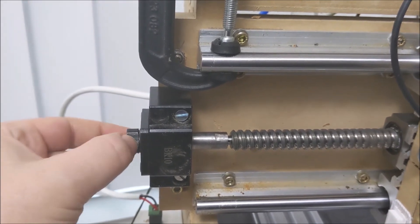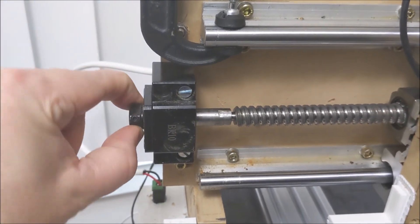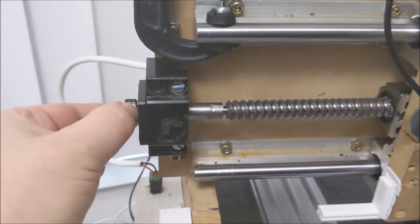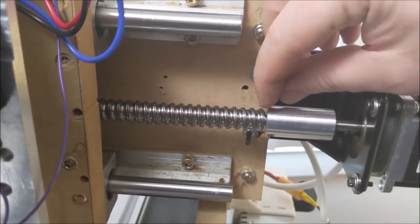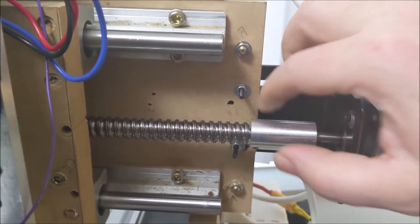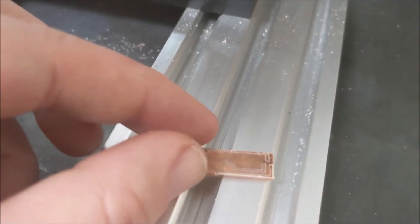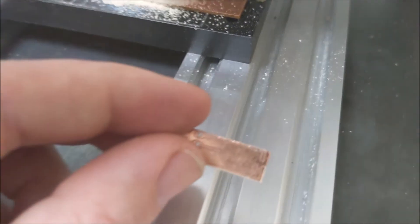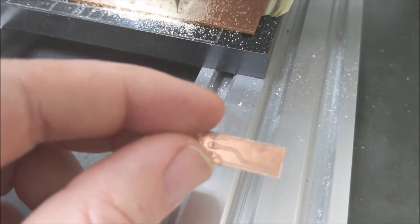As I am literally standing here, I just notice this isn't even tightened on here, so I've got to tighten the set screw and tension it right. So over here on this side, there's only about 10 millimeters. I just made a straight coupling to the motor, which is on what I would call a spring mount. I can already tell that the backlash I was seeing in the belts is probably gone. I want to look at this under the microscope and see how centered everything is, but it actually looks pretty good.